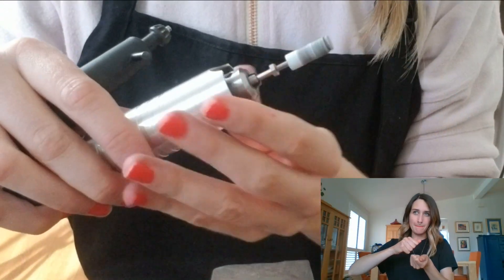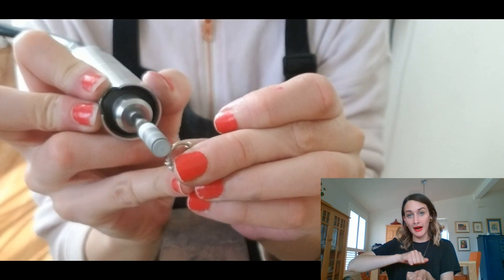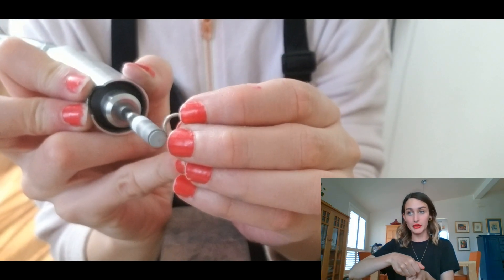These little wheels are kind of almost like compressed sand, and what they do is allow me to grind down the remaining surface before I even polish, so it smoothens it out completely before the primary polish. Because the worst thing that can happen is if you have a piercing or any type of body jewelry that has a rough surface — if your jewelry isn't properly polished, when you insert it into your body, it could create little scratches, it could tear your tissue, and that can lead to infection, irritation, or even rejection of the piercing itself. So you really want to make sure the piercing you're putting in is properly made and highly polished.